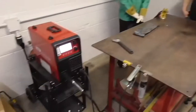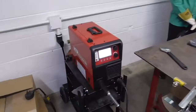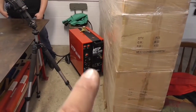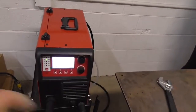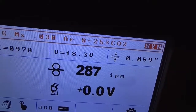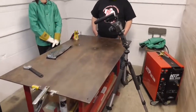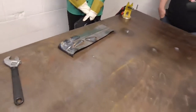Today we learned that both machines weld, and they weld pretty good. But setting up the inverter is more involved — when you change heat settings for different materials you have to reset wire speed and voltage separately and dial in the ratio. On a synergic machine, one dial adjusts both voltage and wire speed at the same time. The arc stability control is absolutely unmatched, helping you produce better welds whether you're a beginner or a pro welding in hard-to-reach areas.